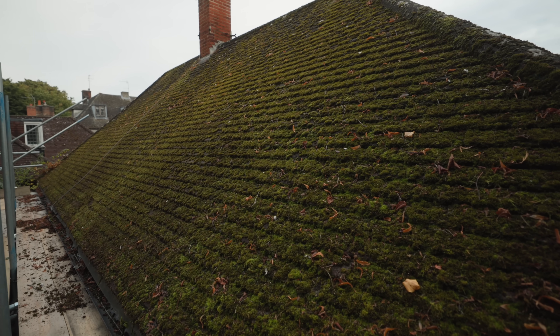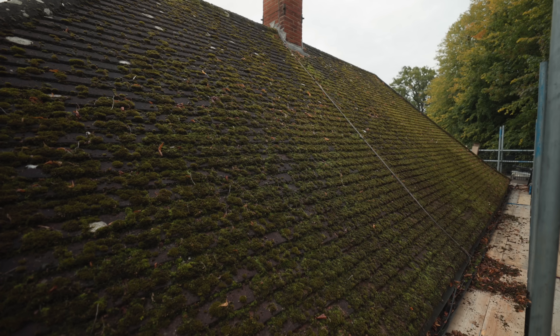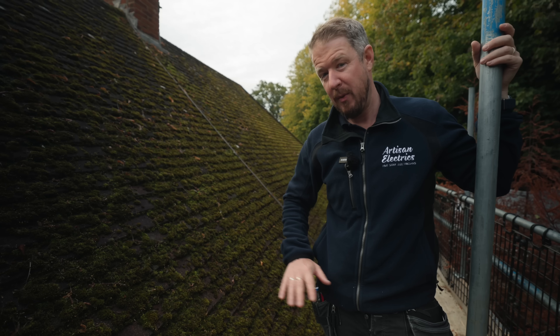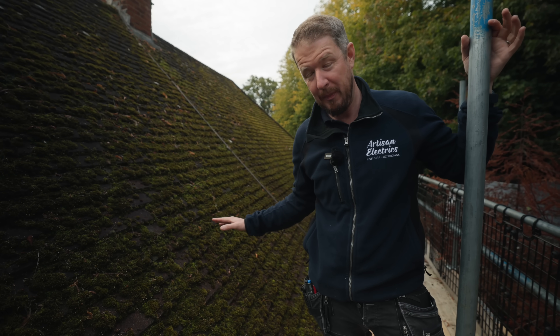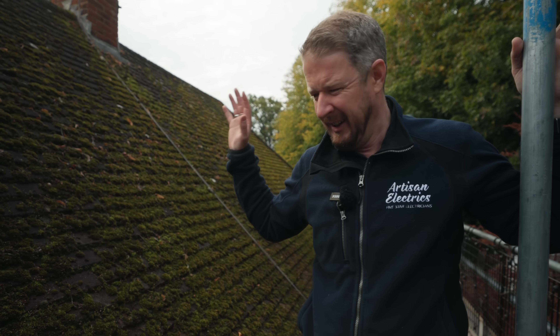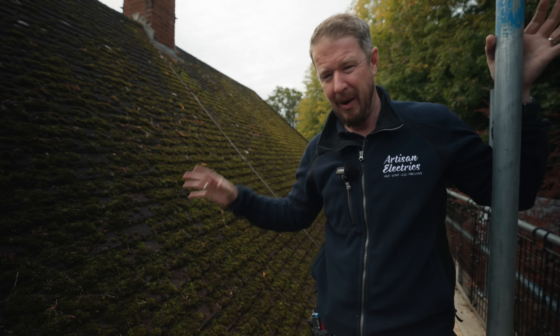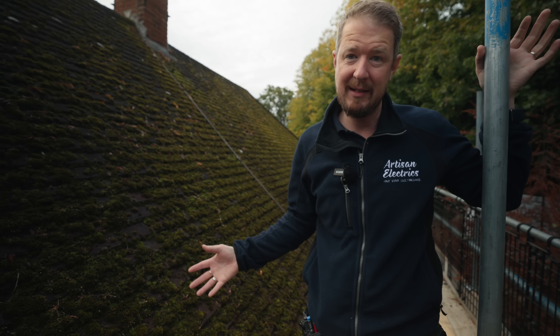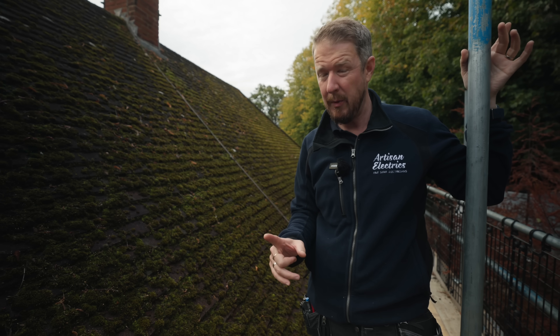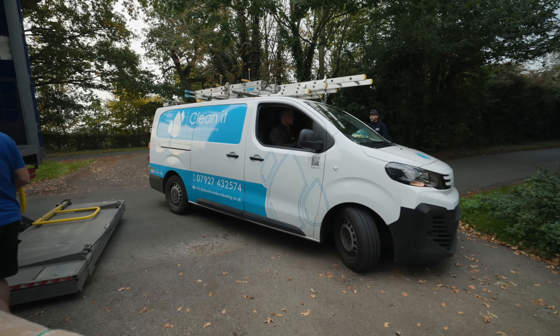You may have noticed there's a slight problem — roof moss. The roof is absolutely covered in it, and if we were to just lay solar panels over the top of this moss you can imagine the chaos that might ensue with damp. When the panels get hot the moss heats up — it could even be a fire hazard. So the first thing we need to do before we can start laying any panels is get rid of all of this moss.